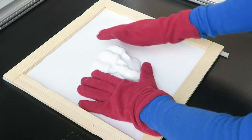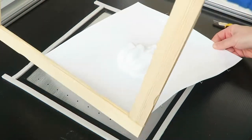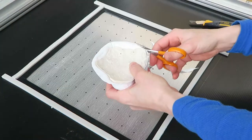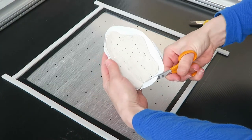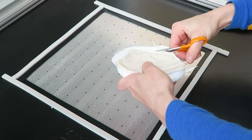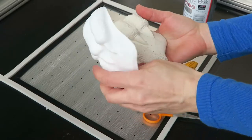This 0.03 inch styrene is more forgiving than PETG, stretches beautifully and picks up a lot of detail on the first try — super easy. The challenging part is removing the mold since it does undercut slightly in some areas. By trimming away all of the excess I'm able to flex and wiggle the part free.